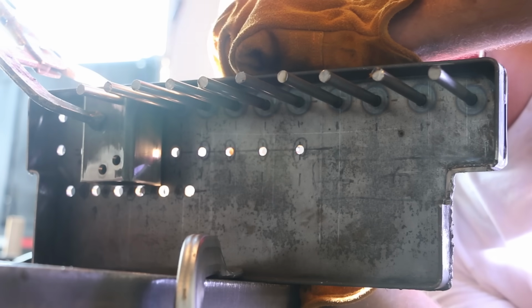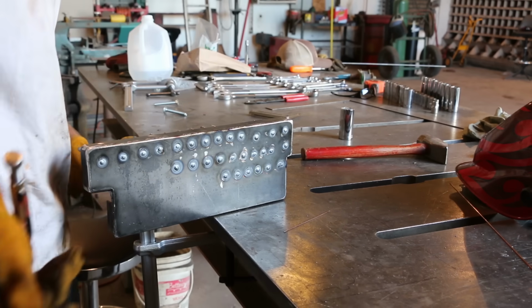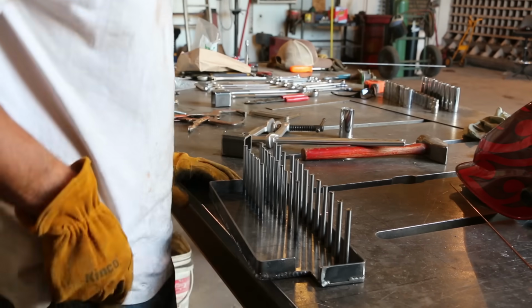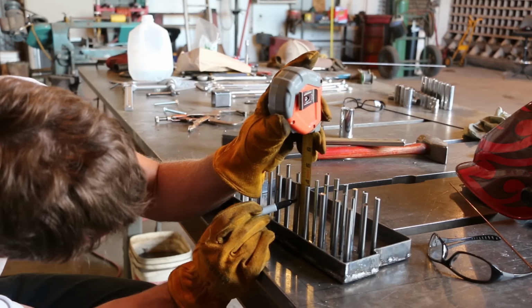I had to drill a couple more holes in my square tubing block to get into the corners of the socket tray, but I was able to use this process for all of them, and it worked really well. I figured out how high I wanted to cut them off at. I decided they should be about 1/4 inch lower than the tops of the sockets.